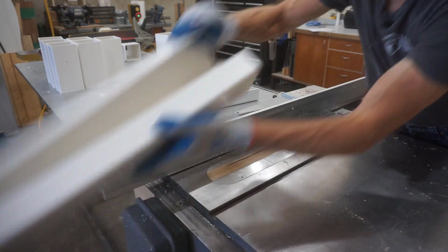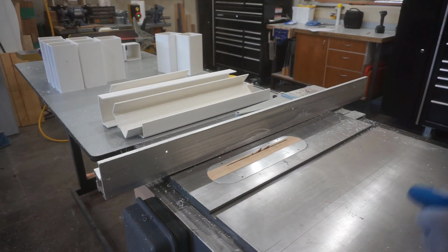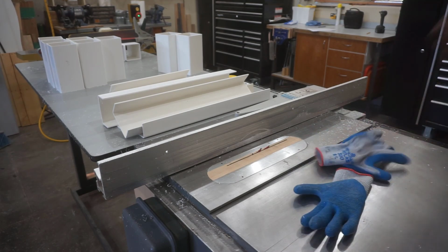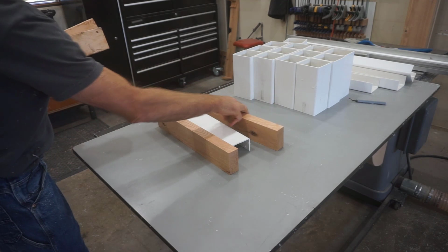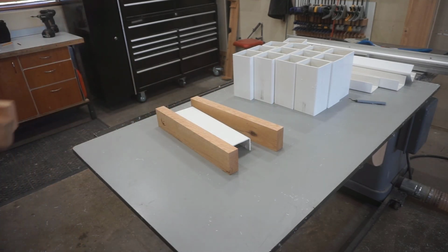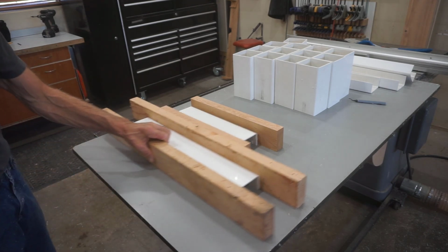And I'll trim these top and bottom pieces to the right size later on in the build. That's because, as with wood, you can cut vinyl off, but you can't cut it on. As long as you're in measuring and cutting mode, cut a couple of scraps of straight wood for each organizer, about the same length as the pieces we cut for the tops. Anything will do as long as it's stiff and nice and straight.